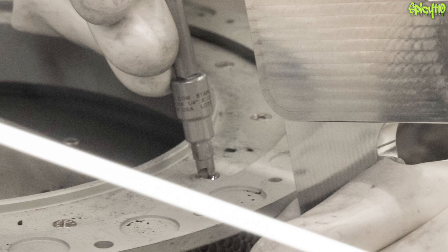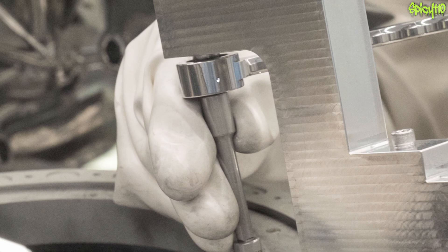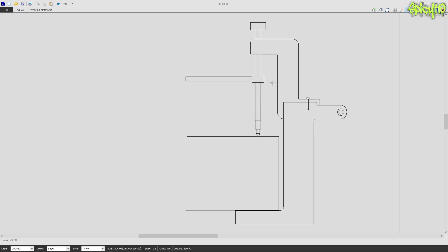This screwdriver bit is a little bit weird — but that shape is to match those fasteners. You can actually see what it says on it: about a quarter inch, something, USA. But that is just a socket bit, that is a ratchet extension, and that appears to be a ratchet. You've got this thread, and you can see from the angle of those threads that if you turn it right it's going to go down, applying pressure at the top. I believe this will be a free-moving ratchet mechanism, because if it wasn't, you wouldn't be able to turn it many turns before it got stuck against the side of the housing. This is just a bolt to apply pressure — I assume the underneath is like a foot. The TAGSAM is put into it and you clamp it through the screw to get good force onto the screw head, then use the ratchet to loosen it off.